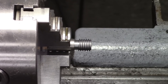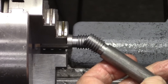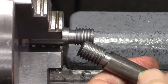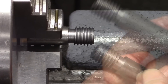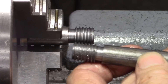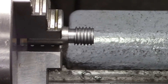Well, I'm not sure what conclusion we came up with there, but in my opinion when I fed with the cross-slide the results were a lot rougher — you can see the difference there. This is with the compound. Ultimately I think it has to do with the solidity of your lathe, how rigid it is. Feeding with the compound is a little easier on your lathe; feeding with the cross-slide puts more load on the tool. But that's just my opinion — be sure and leave some comments. That's amazing right there — that was with a half-a-thread tool. Anyway, thanks for joining me. Be sure and subscribe and ring that bell.